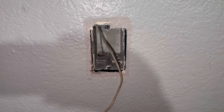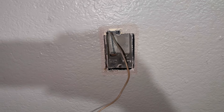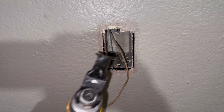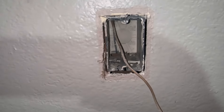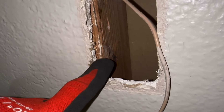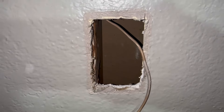If you don't have an oscillating tool you can use an old school handsaw. Again for safety reasons, make sure before you start working on your outlet or light switch — regardless if it's 120 volts, 240 volts, or low voltage — that you ensure there is no power going to the line. If you're using your oscillating tool or handsaw, be careful that you do not cut the wires; go very slowly. Here you can see we cut the old nails out. The box did fall — if it falls, don't worry about it.